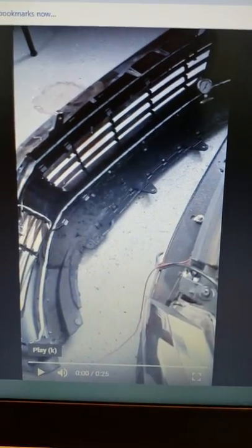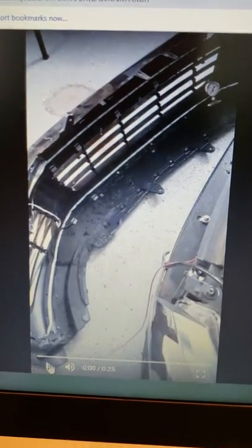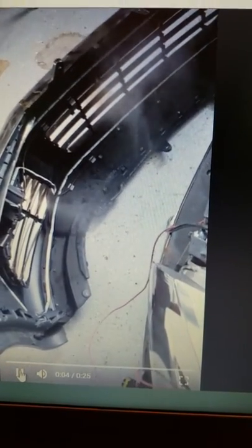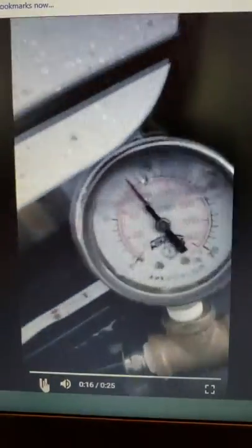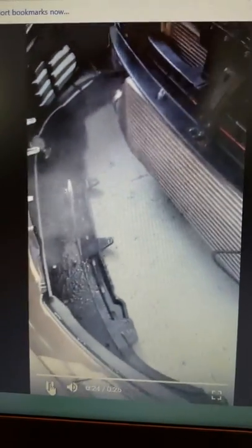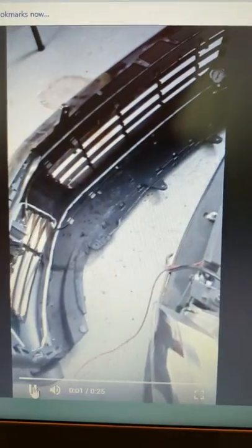Here's a quick video testing the pump connection and activating it at roughly 90 psi. As you can see, there are conical spray patterns misting very well. At that point I had to turn up the set screw on the pump, which is very easy — I bottomed it out and eventually got up to the maximum pressure of about 90 psi running seven jets.